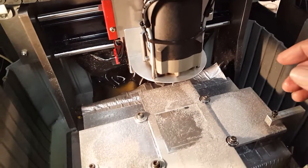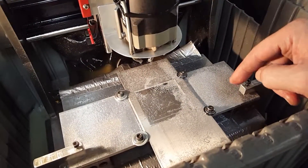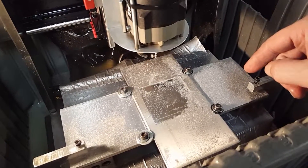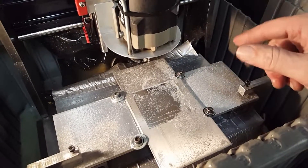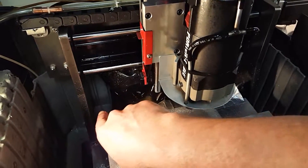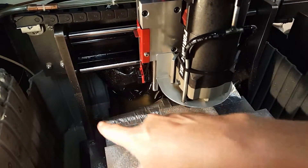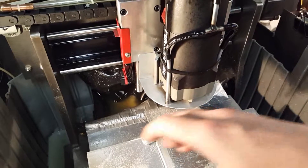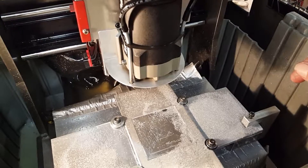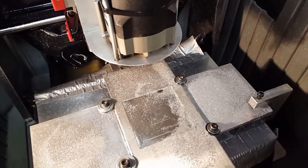I'm not sure exactly when, but I'll be doing some work with this. I got a T-slot table that will fit with a little bit of jiggery-pokery — I'm going to have to cut it back a ways, or have another part lasered out that will accept it going all the way back. That will give me much more X travel, and it'll be heavier, so it'll give me more stability in the cut.